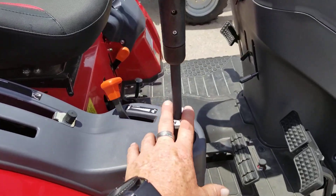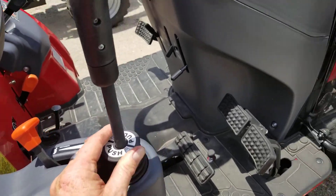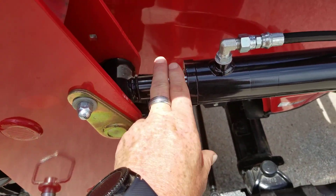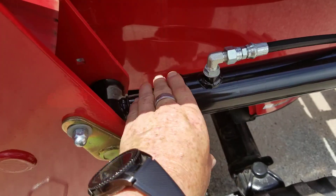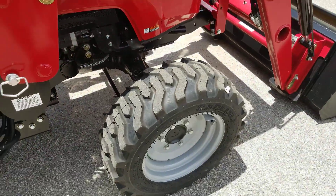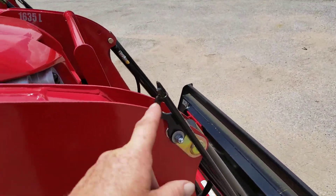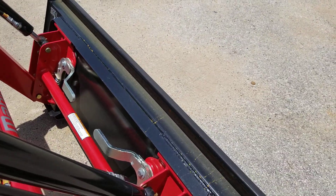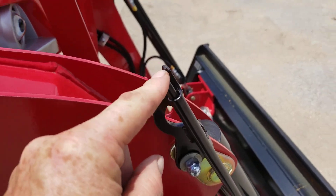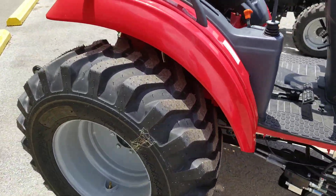The loader handle can be locked down while it is in the air for safety. But when your loader is always in the air, you want to put a piece of angle iron in here and drop it down on top of it for safety purposes. Another feature is the bucket level indicator — whenever your bucket is flat, you have a level indicator so you can see where it's at, useful when you're dragging dirt and need a smooth application.